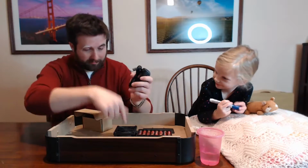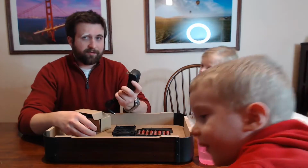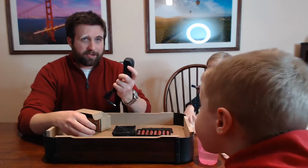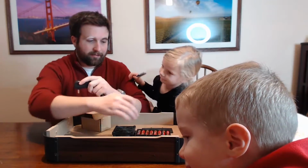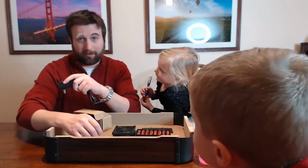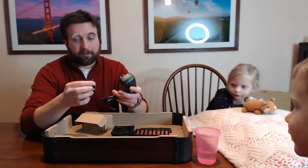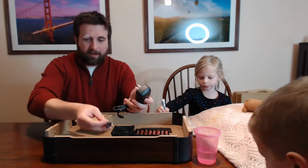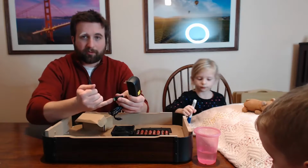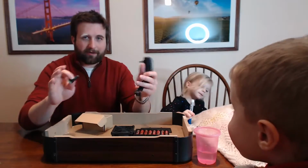So we're going to do the same thing with this guy. I bought this adapter, cost $6.50, which is actually the same or a little bit cheaper than the pack of 8 Duracell Quantum AA batteries. I bought this off Amazon, and this is great because it comes with the barrel plug, and that means we can mount this here in the side. It comes with screw terminals, which makes installation even simpler. And once we do the conversion, it'll never take another battery ever again.